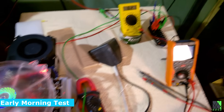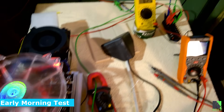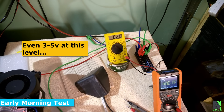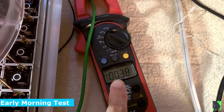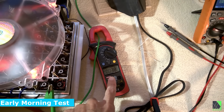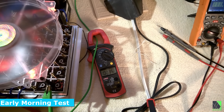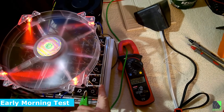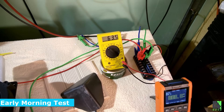The temperature and the voltage are interrelated, but it's not harmful. In this case, you're looking at one or two volts of variation. It is going to climb a little bit. And we're now getting 300 milliamps — we're getting slightly more solar radiation than before. So this is very early in the morning, and I would expect this to get stronger. Now, what's going to happen is, as these diodes start to reach their operating temperature — in other words, they warm up — that voltage will come back down to about 61 volts or something like that.